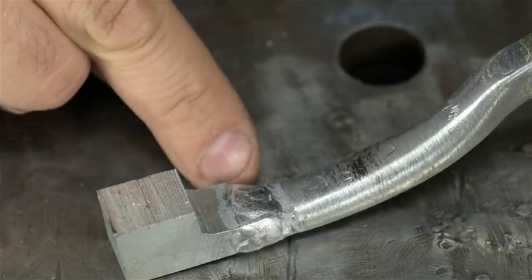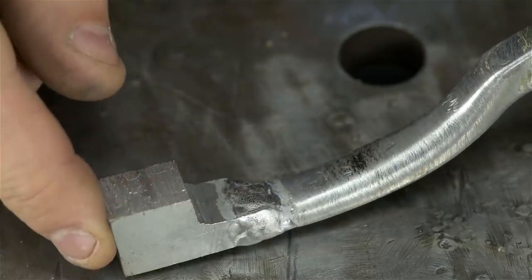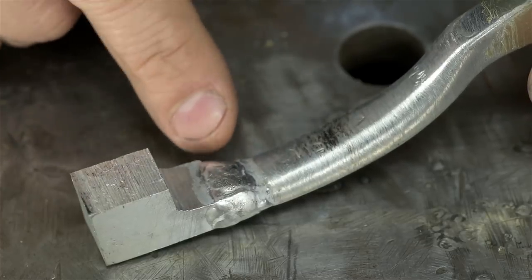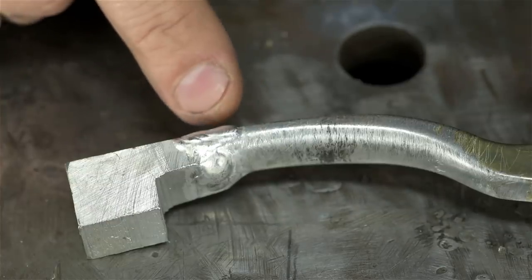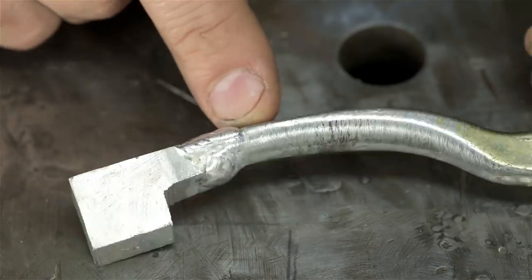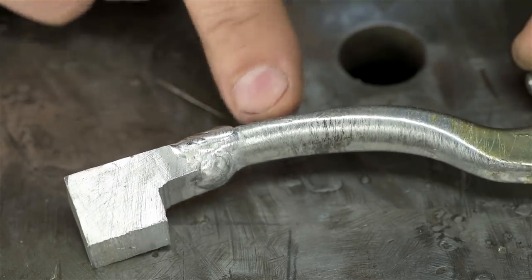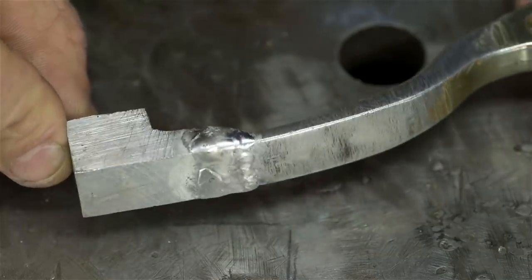After ensuring I'd welded it all the way through, I came back and filled it, trying to get at or above the original surface. I don't think I see any low spots, but I'm sure they'll pop up once we start grinding. It's always better to lay more material on there and then take it away than to fire the welder back up to fill small holes. The other thing to watch out for with these kind of repairs — or build-ups — is to not undercut your original part. If you start to lose one of these sharp edges, you can spend a lot of energy chasing your tail. Once you get below the original surface, you have a lot more grinding and sanding to do. But from here, so far it looks okay.